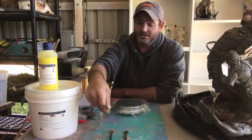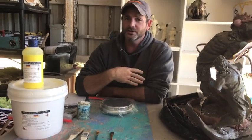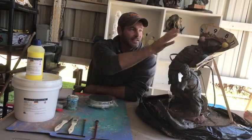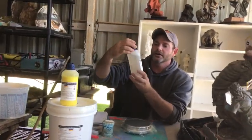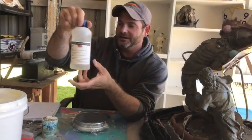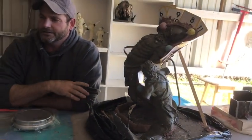You're also going to need some brushes — multiple brushes for every single coat. What we're going to be doing is what they call a brush-on mold. That means we're going to put multiple, multiple layers on our sculpture until it builds up a thick, heavy-duty shell. We're also going to use a product called thixotropic — it's a thickening agent, and I also bought it from GT Products. Later we're going to want a thick rubber shell, and this is going to thicken up our rubber like icing so we can fill in undercuts.